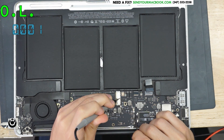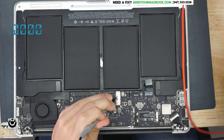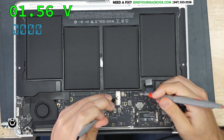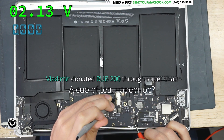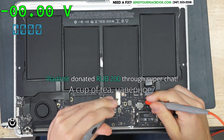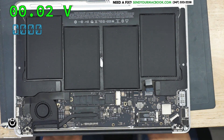Is PP3V42 present? Paul's multimeter software is being a troll — why are you in ohms mode? Show me voltage. There we go. So you have 2.2 volts on PP3V42 — that doesn't make any sense. Input to PP3V42 is 17 volts, but PP3V42 output is too low — 2.13 volts makes no sense. So this turned on, then turned off, and PP3V42 is too low. PPBus is, of course, not going to be there properly if PP3V42 is too low. We're getting 17 volts into PP3V42.